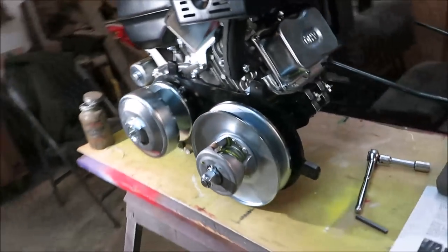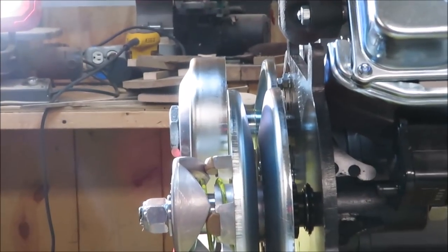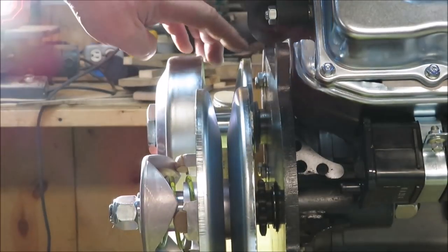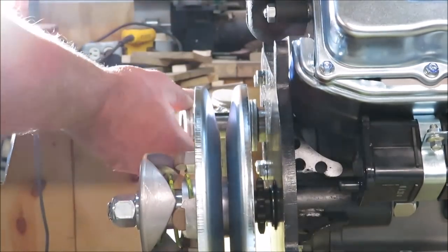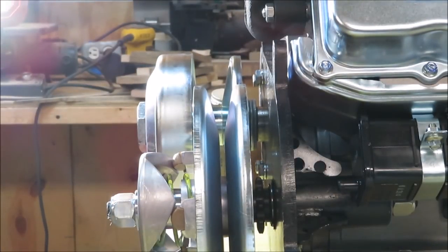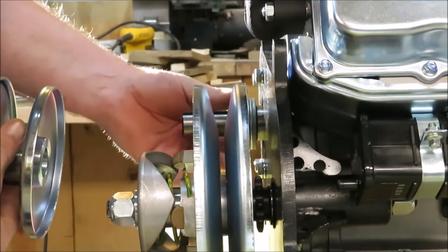We need to line up this pulley with the pulley in the back — looking straight at it from behind. With three washers it looks like the driver pulley is still set back a little further than the driven unit, so we add a couple more. With five washers it looks better, though we'll also try four to fine-tune the alignment. We settled on four washers for now but we'll keep the extras handy in case we need to adjust.